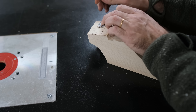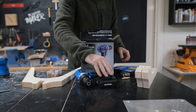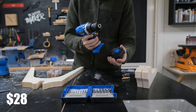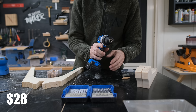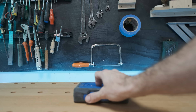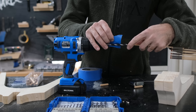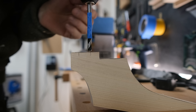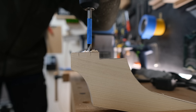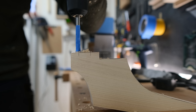The next step was to glue the leg pairs together using dowels for extra strength and alignment. For that I needed the drill and drill bits. The drill was also $28 and included a battery and charger. It's a slow-charging 12-volt battery that takes three to five hours to charge. I taped the drill bit at two centimeters to ensure I could fit the four-centimeter dowels. I measured where I wanted the dowels and drilled the holes with an eight-millimeter bit, making sure to go straight down and not at an angle.